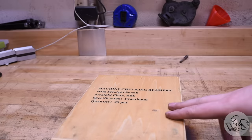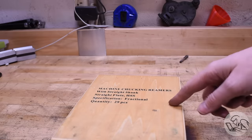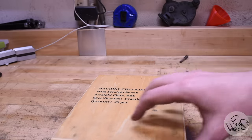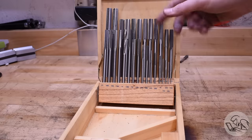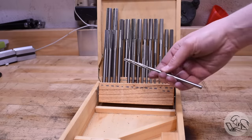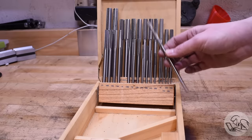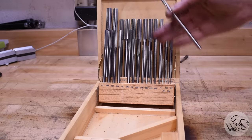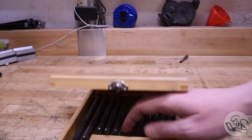Next up is reamers, and I recommend the same strategy as the drills: buy the cheap import set and then as they wear out or you get sick of them, upgrade the common sizes. I'll link to this set below - these sets are pretty good value. Make no mistake, these are not very good reamers, but for the one or two times you're going to need most sizes, they'll do an okay job. For really common sizes, like a quarter inch, I went on MSC Direct and bought a real high-quality one. A single high-quality reamer you can spend a lot of money on, and it's going to serve you extremely well, without spending a whole pile of money on all the other sizes you'll use once or twice in your lifetime.